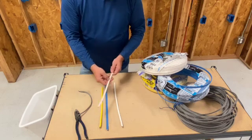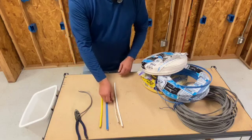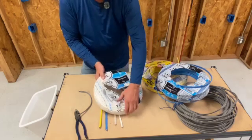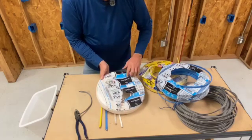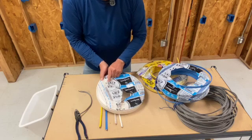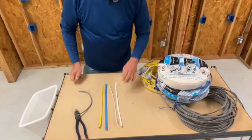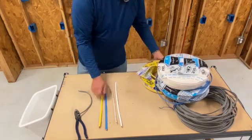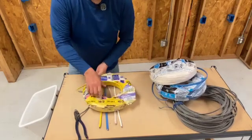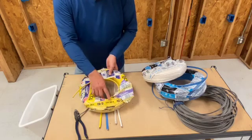And if you just have white, you're going to have to look on the packaging and it tells you NMB and it tells you the wire size. If you guys look on your packaging: 14-2, 250 feet. So 14-2 means it's on a 15 amp breaker. This one would say 12-2 — here, I've got some 12-2 right here. 12-2 NMB. Yellow.